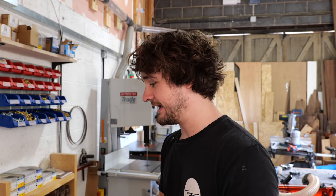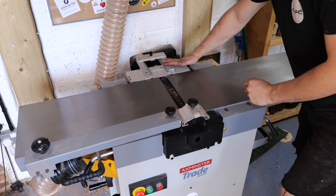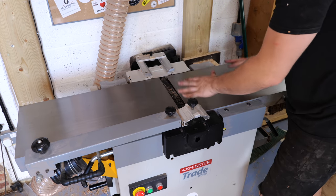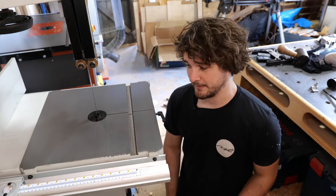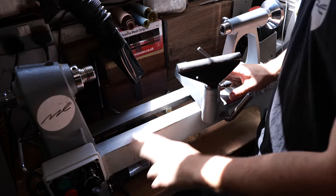All the machines have been scrubbed down — that is by far my most favourite part afterwards, not throughout, as it's disgusting. The next part is to wax the top of these cast iron tables, and this is the point where you've got to work out what do I want to be grippy and what do I want to be slippy. For example, a planer bed — you want that to be slippy because you want the material to pass over it easily. A bandsaw table, for the exact same reason, you want that to be slippy.